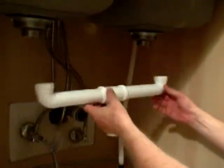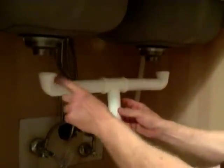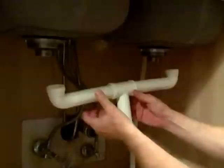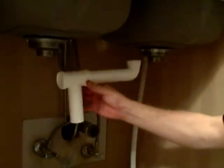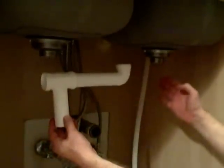If you're changing your under-sink drain pipe under a kitchen sink, I'm going to go over all the steps and show you a couple different options. The first thing you're going to be looking for is whether you have a center outlet, two tubes connecting directly in the center, or an end outlet where it's a T that starts on one side and connects both of them.